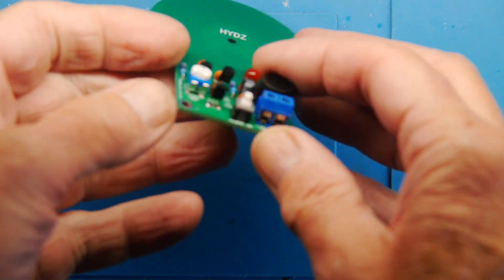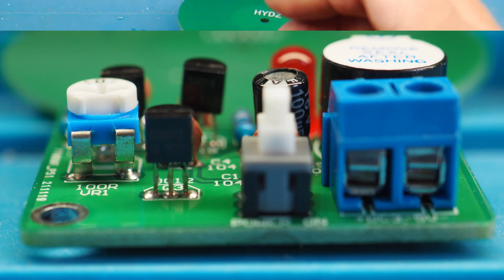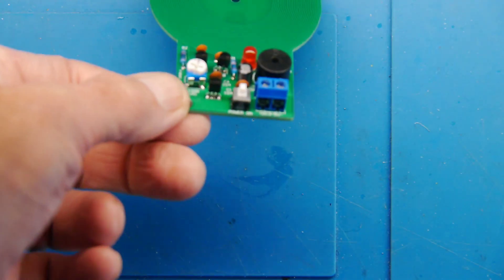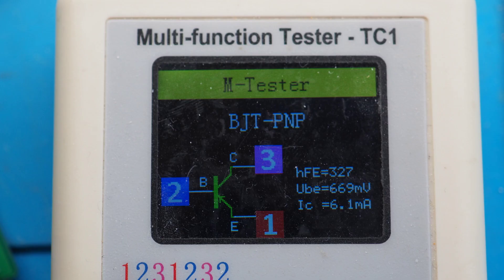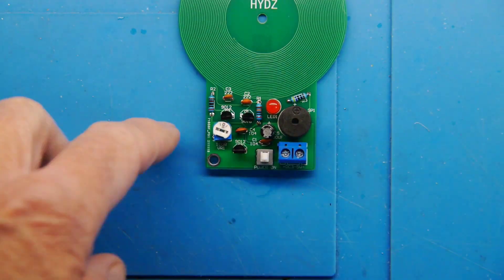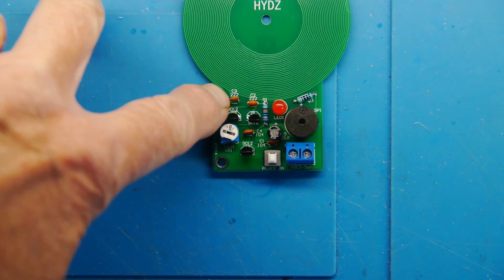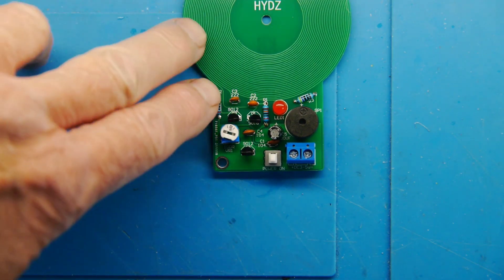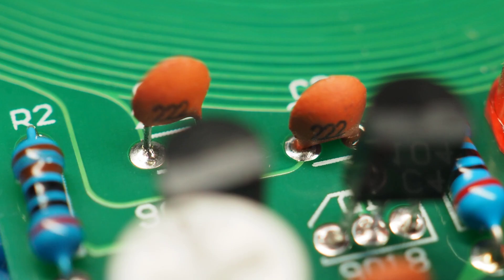There are two different types of transistor — NPN and PNP — and here are some pictures of me just checking those. I always check the components before I put them in, and I even measure the resistance of the resistors. One thing I really do like is that the circuit board is actually marked with the ceramic capacitor numbering system, so it's really easy to spot the 222 and the 104. Here are some more close-ups so you can see the arrangement of the components. It took me about 15–20 minutes to put it together.